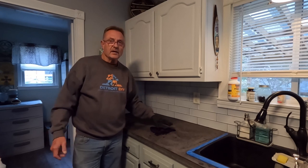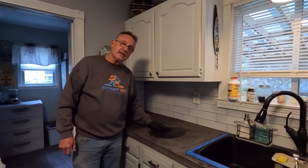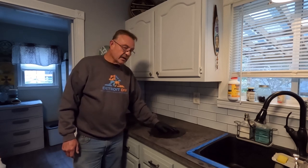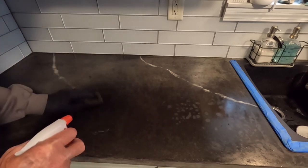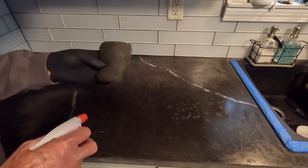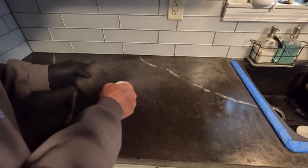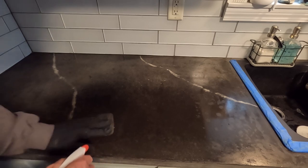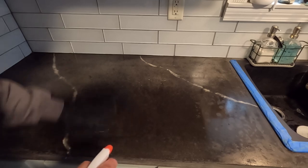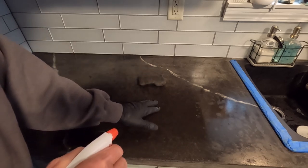The second coat of slurry has been drying for another 24 hours and we're ready to clean it up. I'm going to do the same thing with a damp rag and scrub the whole thing down as good as I can. Now that I have as much of the residual off as I can currently get off, it still needs more but we're close. I'm going to use some triple-aught steel wool — this is one step above the finest — and I'm going to hit it with some soapy water and just give it a scrub to help get anything else off that needs to come loose.